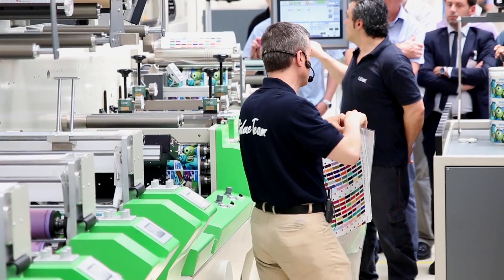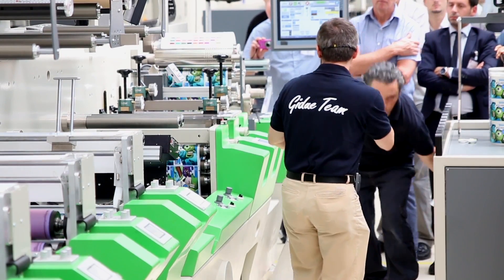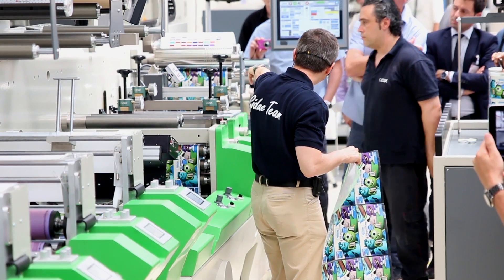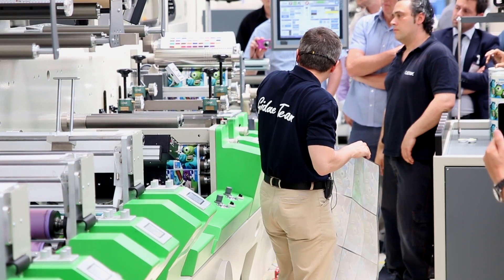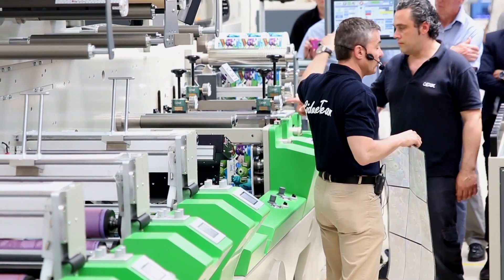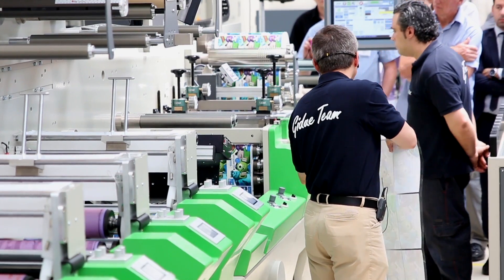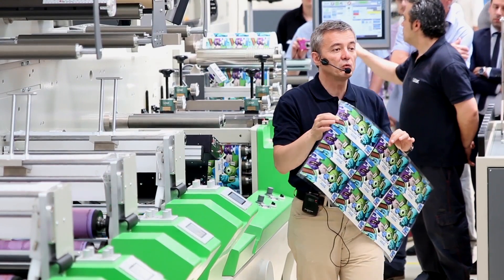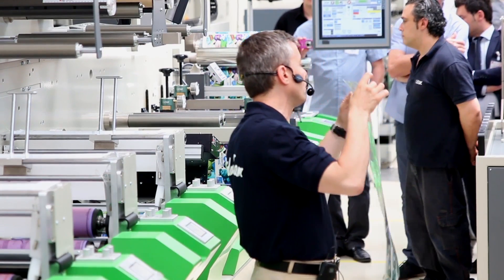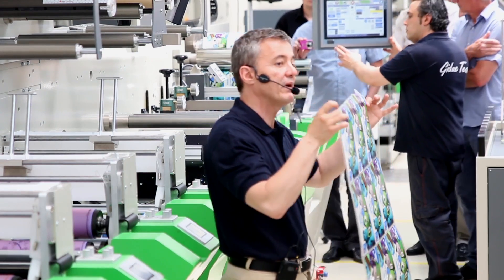Total graphic flexibility. But that's not all, because we need also to die cut. Look what happens: we collect the upper part and then we are ready to die cut without manual intervention of the operator. We were not die cutting before and now we are fully die cutting and stripping the waste without any manual intervention.